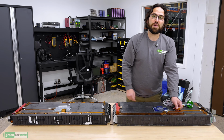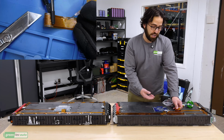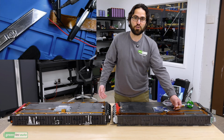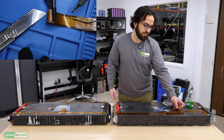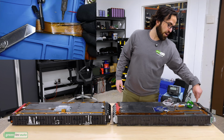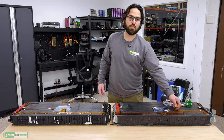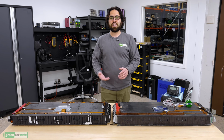And there's 14 pins and it's 14 millimeters wide. You'll only need to solder on to probably 1 or 2 of them for your BMS. So that makes it a lot easier to do. There's no good spot to solder anywhere close to the cells. So that's probably your best bet, or just use the temperature sensors that came with your BMS.